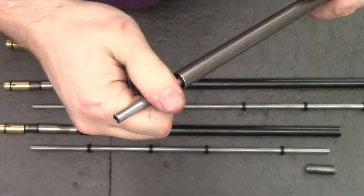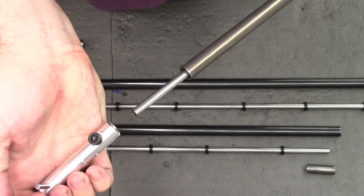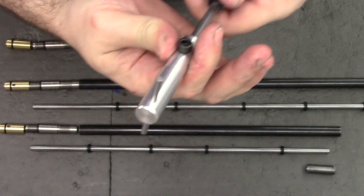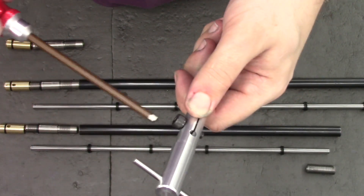Now the liner is quite stiff in the steel part, so what I had to do was make a little tool — just a split clamp tool which when I tighten it up I can take the liner out.